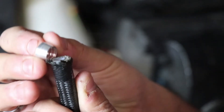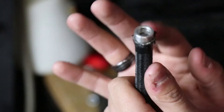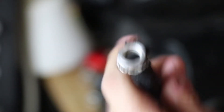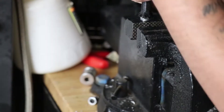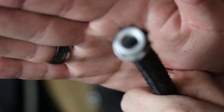Get the little bushing and gently put it around the Teflon tube. Remove any extra electrical tape because that will limit how far you can push the bushing back in. Start pushing the bushing in by hand. Be very careful — there is stainless steel wire in here and you don't want to slip and poke yourself on it, as it's very sharp. Keep pushing it on until it feels like it won't go anymore; you can push it against a hard surface to get it on more snug. The Teflon hose should be maxed out inside the bushing — that's when you know you can stop.